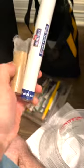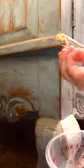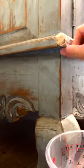We start with Mohawk's epoxy stick. This is a beige color and just mix that together — the goal is to get one solid color. You're mixing that hardener in completely, and once you get that all mixed together you have about five to ten minutes to work with the product.